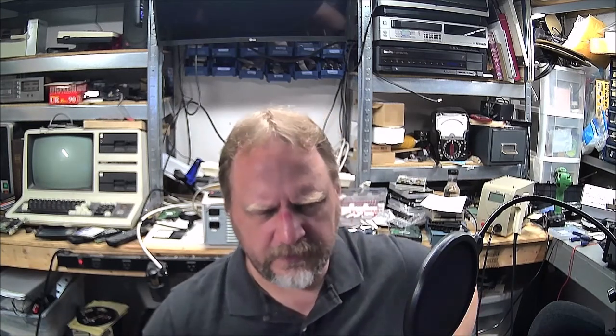And when I put it away, it worked. It's one of those, it worked when I put it away. And so I get the thing out, and I go to plug it in to test it to make sure it's still working, and it powers up. But then I just turn the knob off. It has one of those clicky on-off potentiometers, it's on-off volume, so it clicks off, and then to turn it back on, you click it, and then that's also the volume control. So I turned it off, and I went to get some tapes to put in it. I loaded up a tape to test it, went to turn it on, and the control knob just kept spinning. So something broke inside of it.